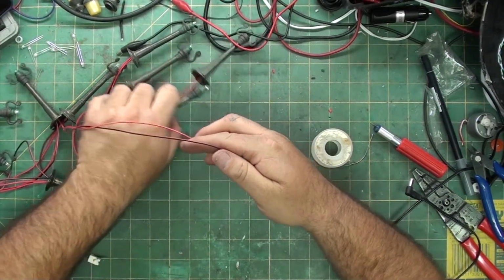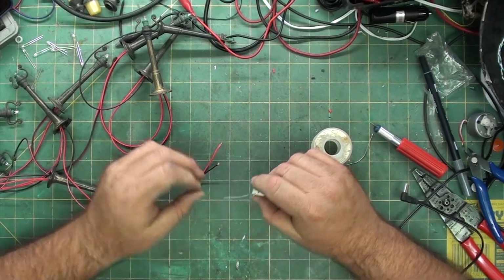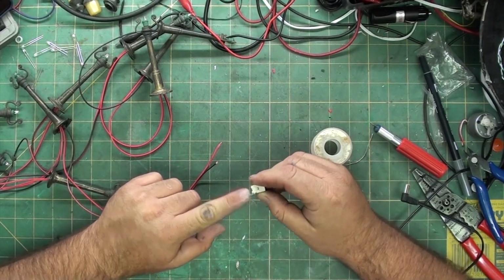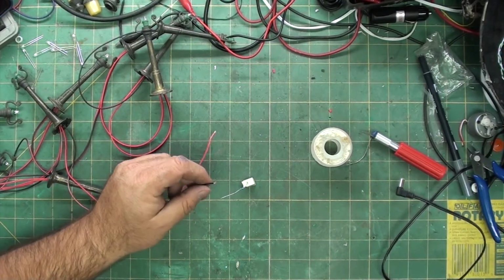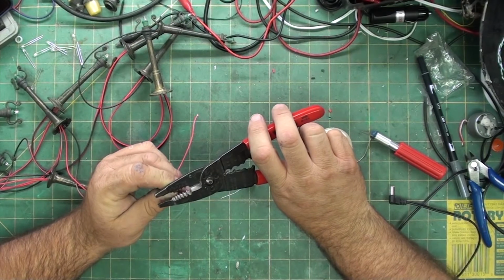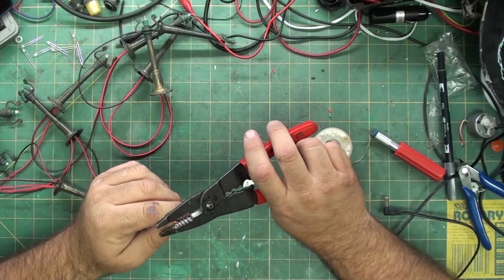Grabbing the other end of these lights, which has the 2 leads I left out. So I'm using this on the ground, the resistor, instead of the hot. And low voltage like this generally doesn't matter. Most high voltage components, it varies depending on what it's doing. The reason I'm choosing the ground is because I can wrap the resistor through 2 different points in case something happens.